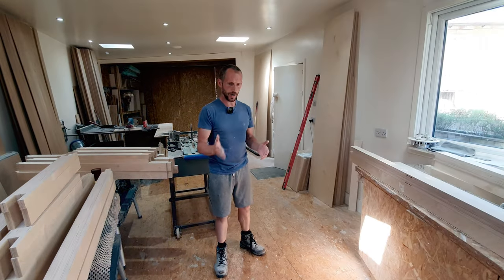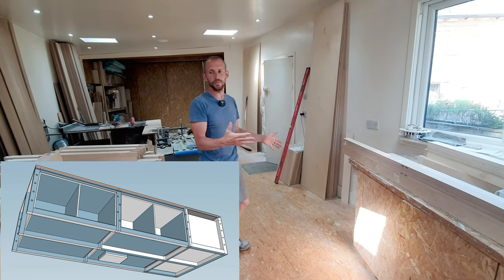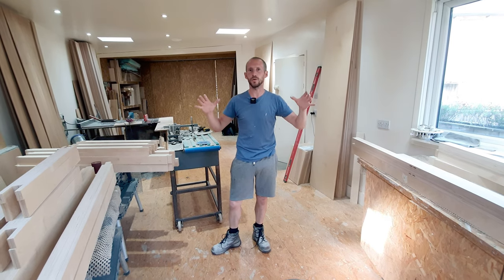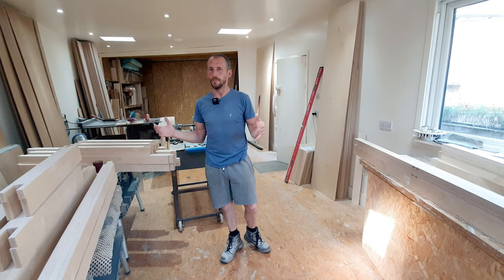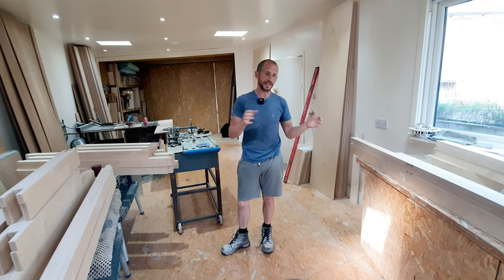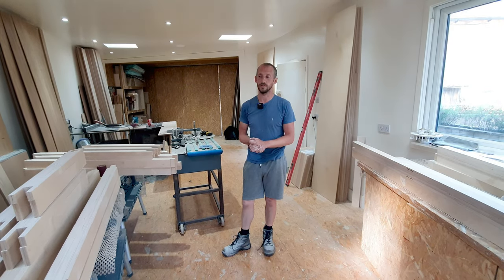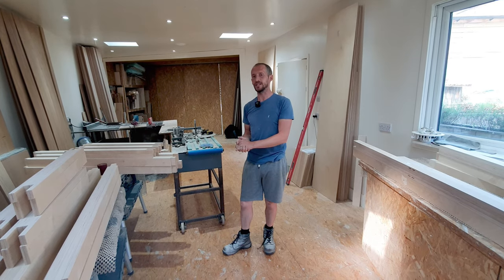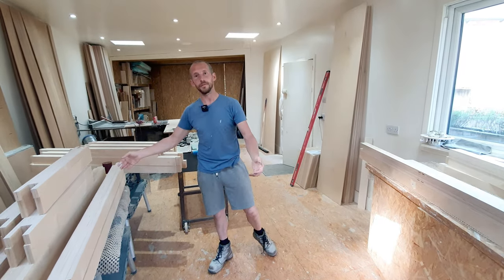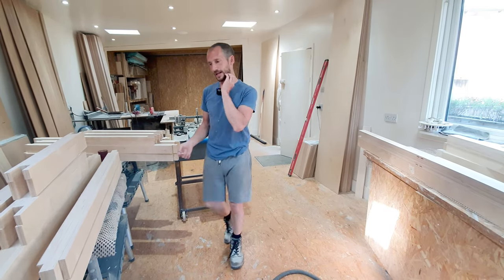So the way it's going to be — it's going to be three frames: one, two, three. And then we've got a tunnel carcass running through the centre of them. The frames give the bench rigidity and the tunnel squares it all up and turns it into like a box. I wanted it as simple as possible for people to be able to make their own bench in the future. You don't need a mortise machine, you don't need a tenon machine. All you really need — you can just glue and clamp them up. Just try to make it as simple as possible.